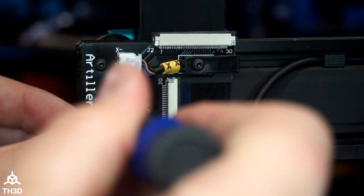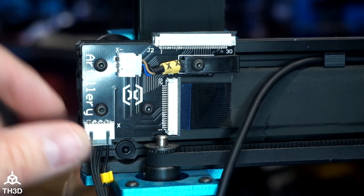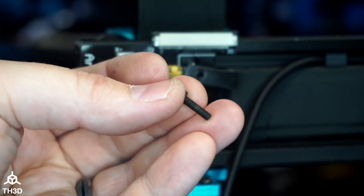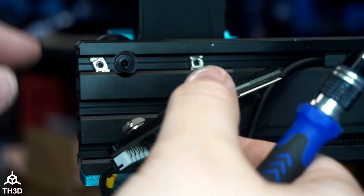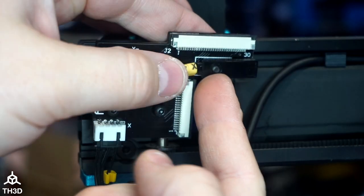Go ahead and unscrew these four screws — just turn these a little bit. You don't need to fully unscrew the two that have T-nuts on the rear. Once they're loose, go ahead and fully unscrew the top one and the same for the one with the X end-stop sensor. Make sure you keep an eye on the bolt that came out of the end stop because it's the longest one and needs to go back in the end stop. Take the two T-nuts out from the top, then take the long screw from the X end-stop and put it through the rear and back through the end stop.